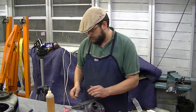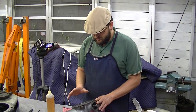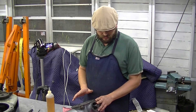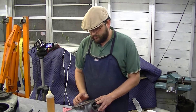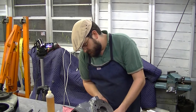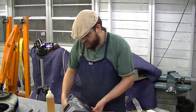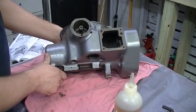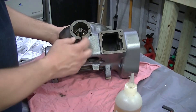Just snug it down. One thing I noticed when I took this apart a few weeks ago was everything in here was really, really tight — maybe a little more tight than it should have been. So I'm not going to go back quite as tight on everything. That set screw really just locked in the brass bushing inside of the quill housing, which I did not remove. The brass bushing is down in here — I did not take it out. I really didn't see any reason to.